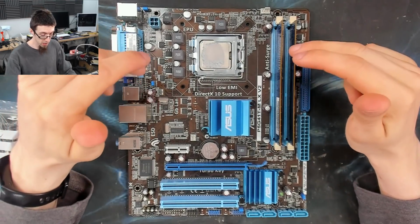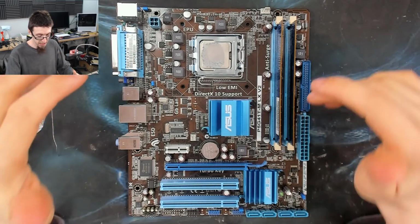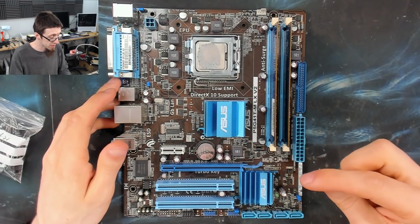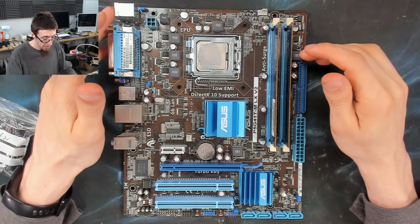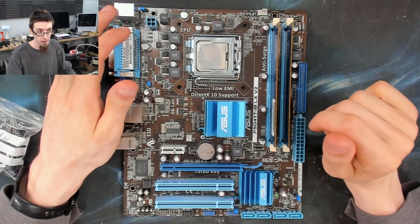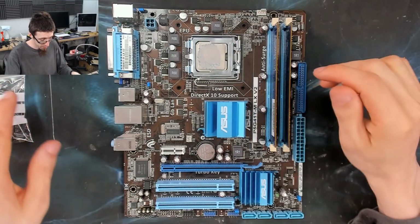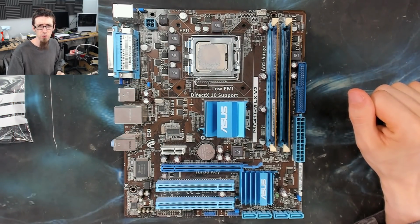Cool, right, so I'm going to go across this board now and remove all the remaining capacitors. I'm not going to bother testing the others. I'm sure there's plenty here, like these ones up here that look completely fine, that are most likely well within spec. However, we'll replace all of them because that was the plan. It seems like these 6.3 volt 820 microfarad capacitors were the problem ones on this board, or maybe it's just these ones that get hammered, who knows. In any case, I'm going to take all of those off the board, so let's hit the fast forwardy section, and I'll see you after the fast forwardy section.